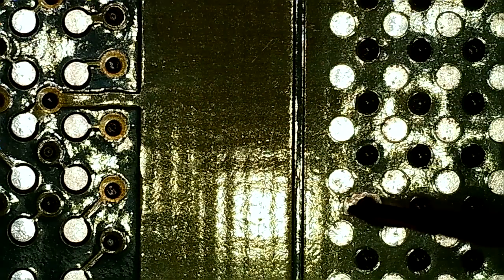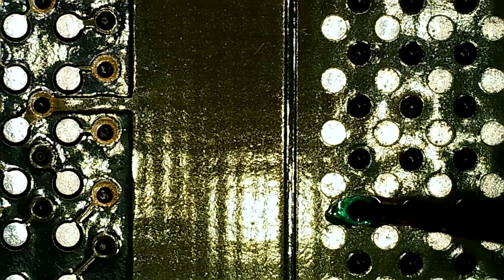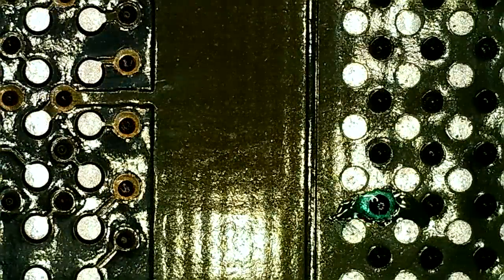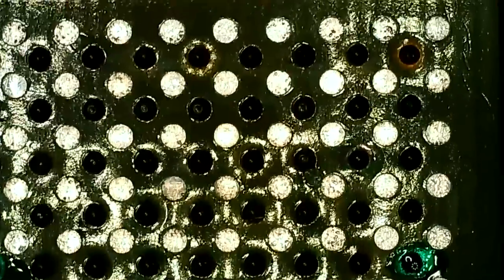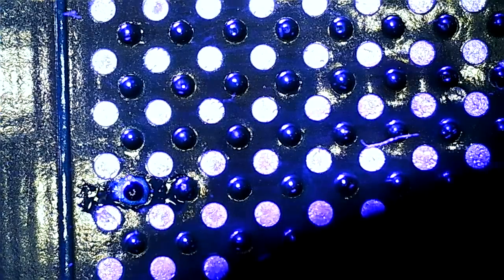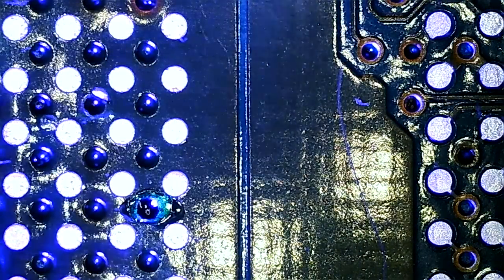So this might not be needed, but I'm gonna assume there should be solder mask on them. There's no harm in having it, as long as it's just on the vias and it's not sitting proud. Anyways, I think that's fine, shouldn't be an issue. So yeah, just some precaution there. I'm gonna harden it now. I don't want it to stick up a lot. I want it just to be an insulator, nothing else. So I'm just pretty much ready to put the chip on again.